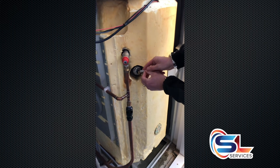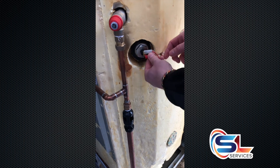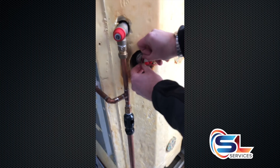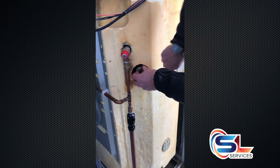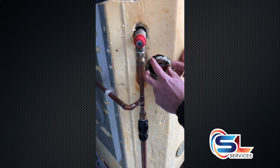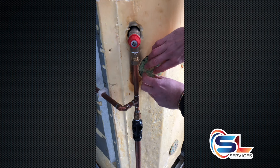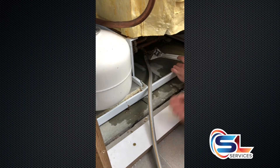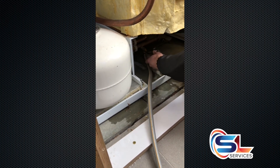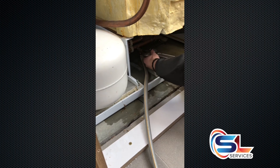Now time to reconnect the cables — as I said, they're not polarised in any way. Tidy the cables up a little bit. Then you'll be able to get your foam bungs and put that back together. That's the water side almost complete. Just going to tighten this drain cock back up and remove the hose. Turn these lever valves back into operation. Then we'll be ready for a refill.